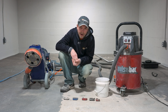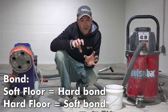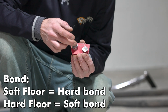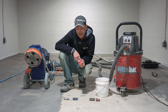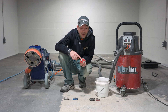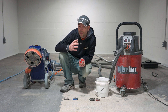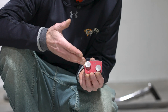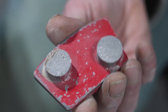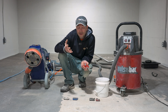The last thing to cover is the bond of the diamond. You're generally going to see three options: hard, medium, and soft. It's important to somewhat match the bond of the diamond tooling to the floor you're grinding. The bond has nothing to do with the diamond itself — it refers to the metal that's encapsulating the diamonds. With a soft bond, that metal wears away faster, continuously exposing fresh diamonds, and it won't glaze over as quickly on a really hard floor. With a hard bond, the metal doesn't wear away nearly as fast, which is better on a soft floor. So it's counterintuitive: hard floors need a soft bond diamond, and soft floors are better served by a hard bond diamond — it just makes your diamonds last longer.